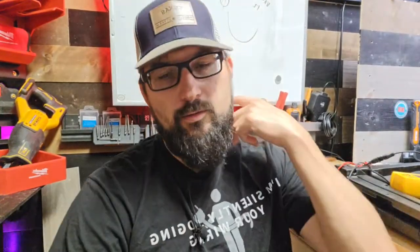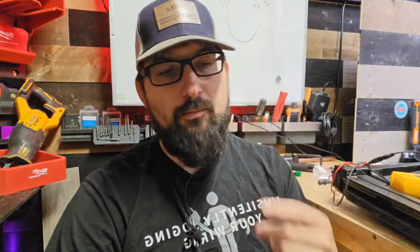Let's see. A light bulb and flashing circuit plugged in the receptacle will get me with an amp clamp on the circuit breaker. Yep. That'll let you know what circuit it is for sure. However, you got to access all those wires. So it just depends on, like, my panel. Ha! No way. No way doing that on my panel.